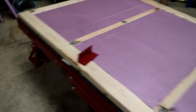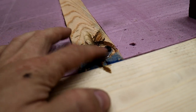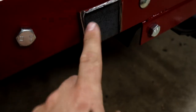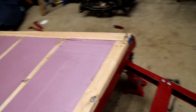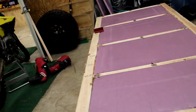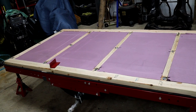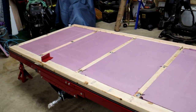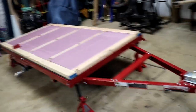To conclude part one of framing the floor — I have bolted down and cut off the tops of the bolts so it sits flush with the floor. I've put a screw in each insert so whenever I remove this at some point, it won't just spin in there. I have cut off the excess pieces of the trailer. I've got it completely bolted down and the frame is attached to the trailer permanently now. The next step is cutting the walls — probably the most nerve-wracking thing because it's really going to start shaping the rest of the trailer. Click on the next video to watch that, and remember to like and subscribe — follow me through this nightmare project.